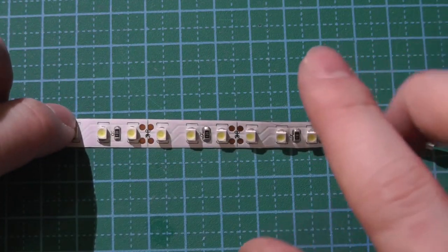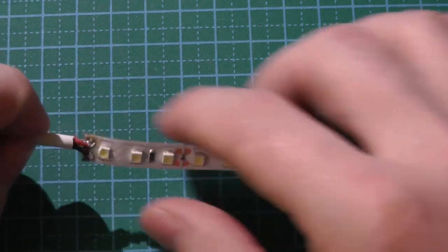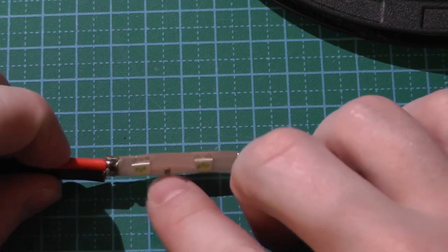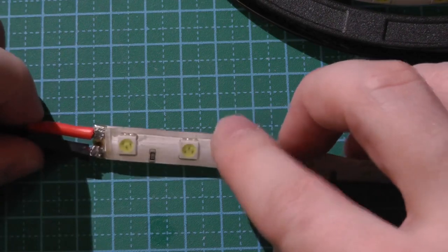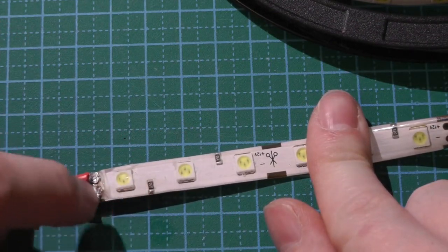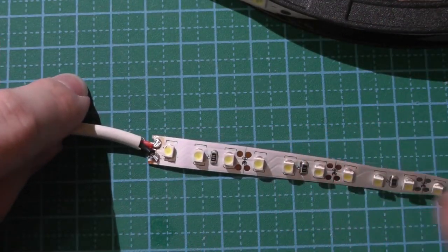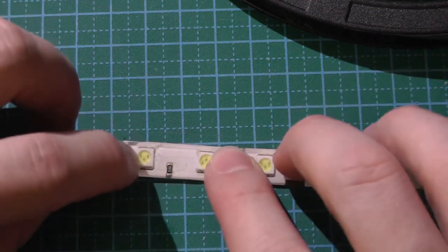The SMD3528 strips are narrower, which gives more uniform light. The other format, SMD5050, has three LEDs inside one package and is approximately 5×5mm. The 5050 strips have only 60 LEDs per meter — 300 per 5 meters. One difference is that the 5050 strips I have come with IP65 protection: a plastic coating protecting from water splashes. For ceiling use, though, this coating is probably not ideal — it slightly reduces brightness, collects fingerprints, gets dusty, and traps heat which can affect LED longevity.